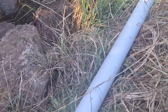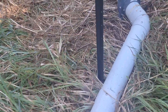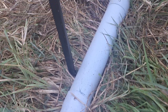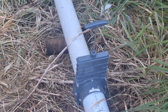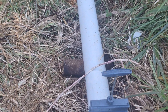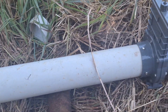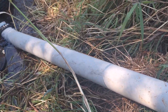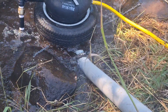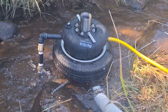We've got it either level or sloping down all the way. There's another join here and an elbow, and then we've got a slide valve — so if you want to service the pump you can turn it off there. Then there's another elbow taking it down into the creek, and another elbow down on the pump before it goes into the pump to level back off.